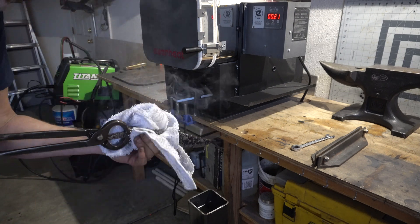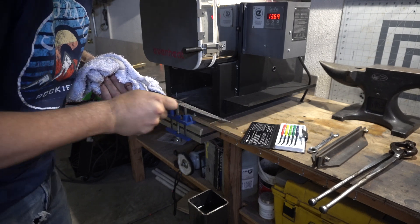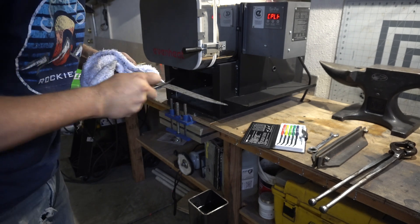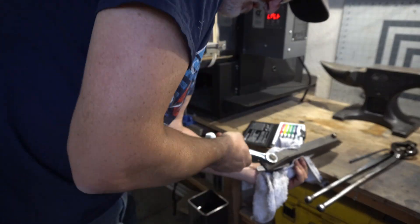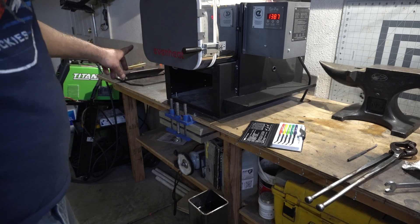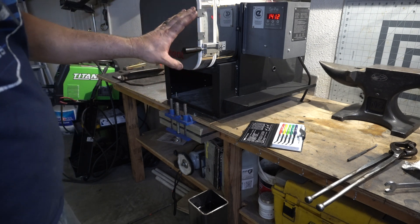Like always, I check for warps first — you've got all the time in the world to check if it's hard. Here I'm using a 65 HRC file to test how hard it is. Now I'm going to get my steel plate set up so it stays straight during the temper. I've got a couple of extra pieces from the same billet — just cutoffs. I've done the whole normalization cycle exactly the same as the blade. I'm going to quench those and do a snap test on them just to see what the grain structure is like.